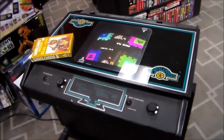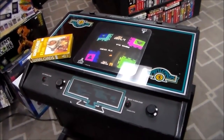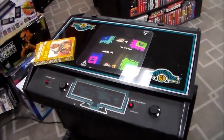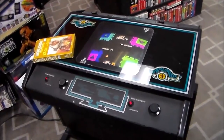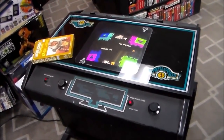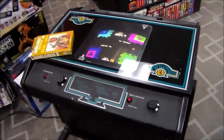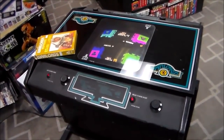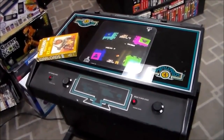So it's really unique that the game board put out a black and white video signal, and it also put out a full color video signal. The upright version had a 22-inch black and white monitor, with the mirror and everything, kind of like they did in Space Invaders. Different company, but same kind of effect. And then the cocktail version had a full color monitor.